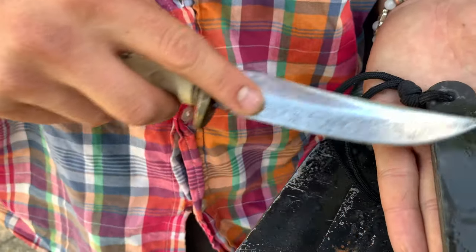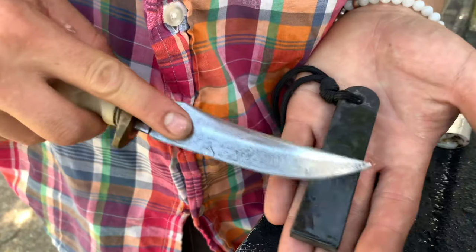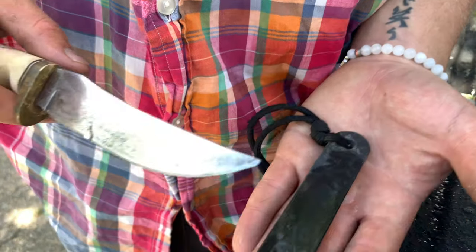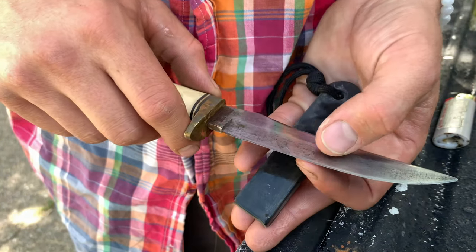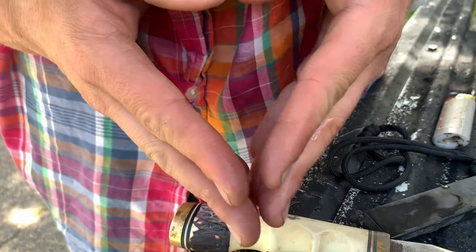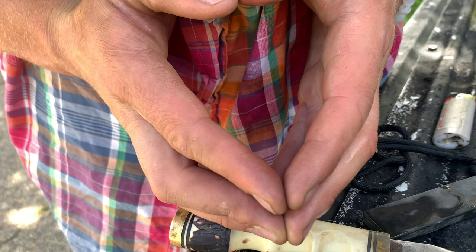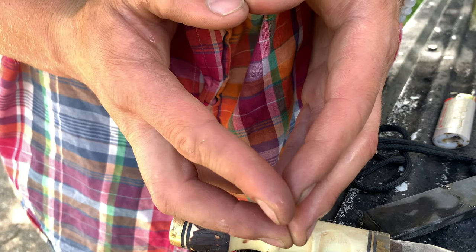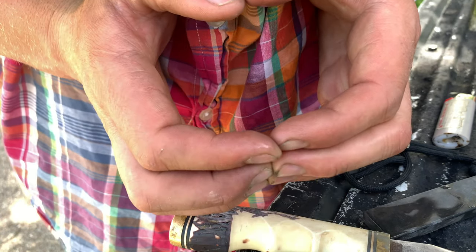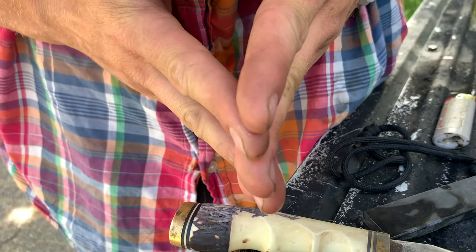Now I'm just going to work my way up and down the edge. I'm feeling for the apex of the edge. If you have a knife that's totally dull that you just can't seem to get sharp, you've got to spend a little more time grinding down the sidewall behind the edge. Because the angle went from being nice and crisp to more blunted over time. If you only reprofile the tip of the edge, eventually you lose the shape — even though it's pretty thin, the end of it is no longer perfectly together.